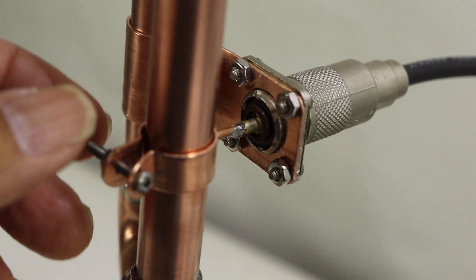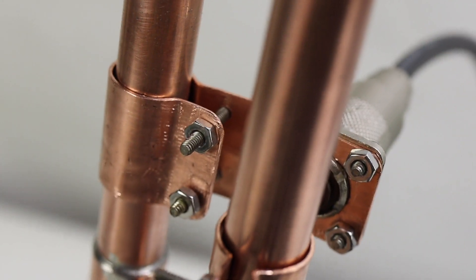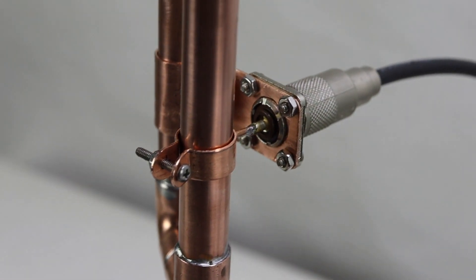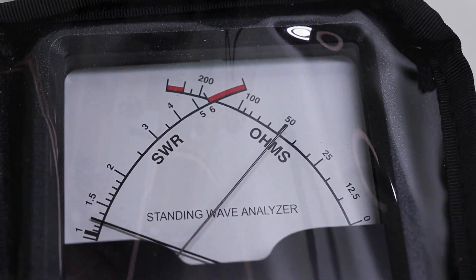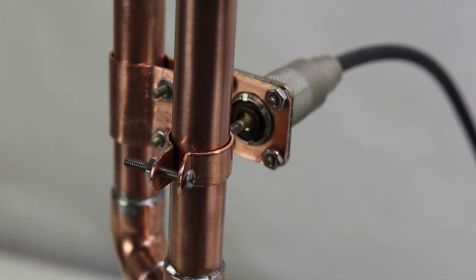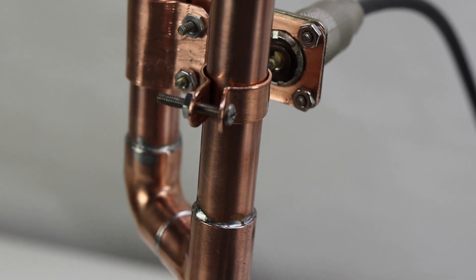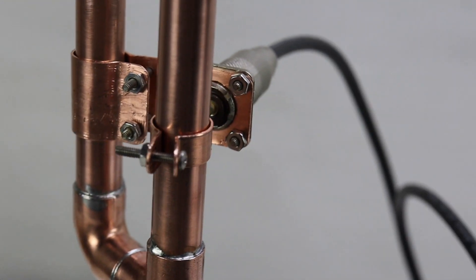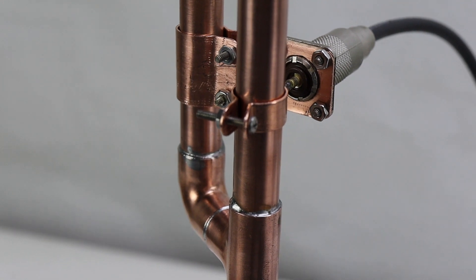After tuning, the way this is made, you just tighten the nuts and bolts — there's no need to solder anything on the tuning assembly. As shown in other videos, holding it down here doesn't affect the match, so you can mount it on a pole. I'll touch it and you can see the meters don't even move. Feel free to give us a thumbs up, subscribe to the channel — we'll be posting a lot about building antennas and using radios. There's also a PDF available, check below. 73s from KE6VRK.